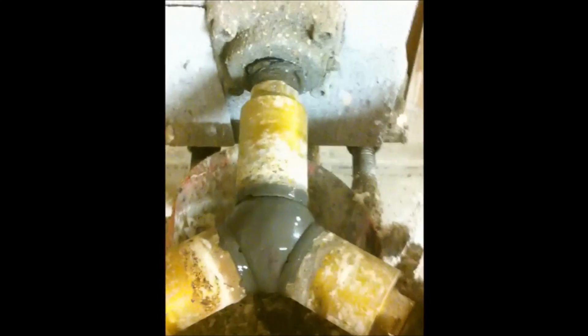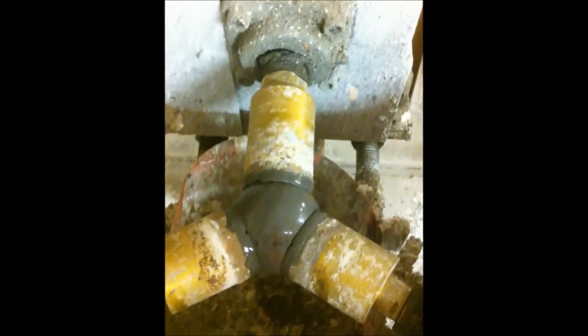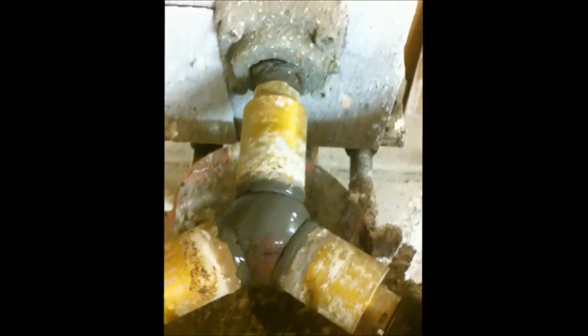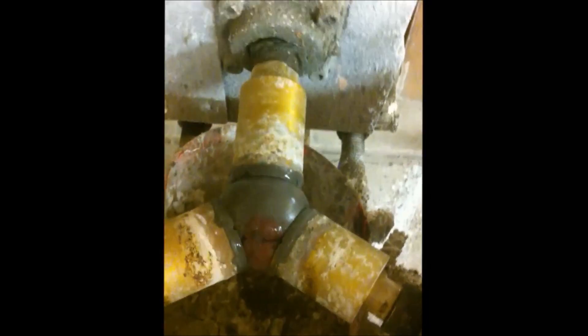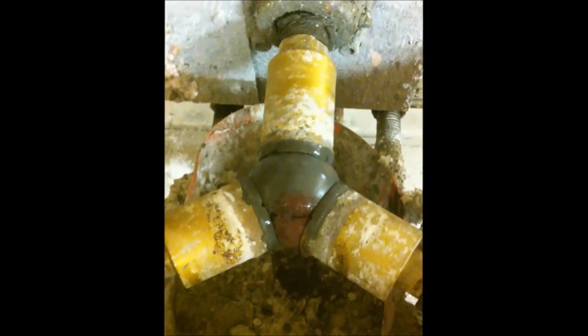You'll notice that the water drip isn't too fast. We get a really good mud on it. The mud keeps helping the tools stay sharp. If you wash it too much — if you flood it — it washes all the mud off and the abrasive action of the mud doesn't help us. It's not there to help us keep this tool sharp.